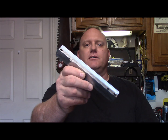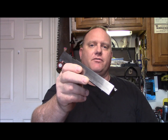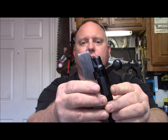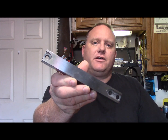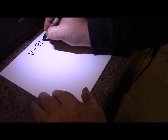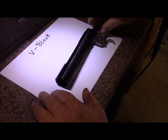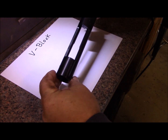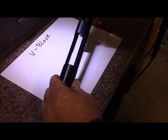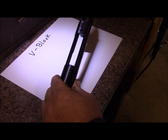Today we're making a V-block. What this will let us do is complete a couple of machining operations on the receiver itself. It's got a slot for the bolt handle, a channel to hold the receiver itself, and underneath it has clearance for a bolt and a socket. I'm going to mill a slot for a side bolt release and I'm also going to tap these out to 8-40. I'm going to need a clamping fixture or a V-block to hold this in the mill securely.